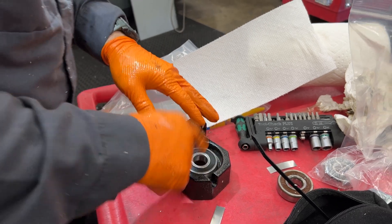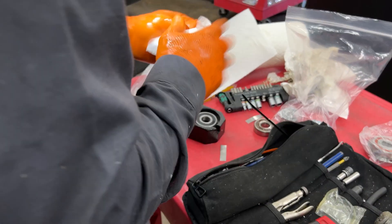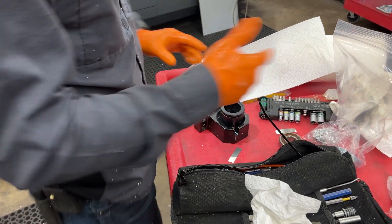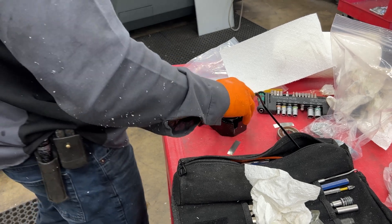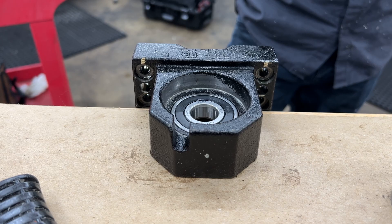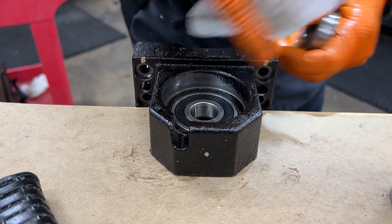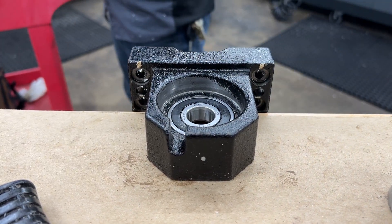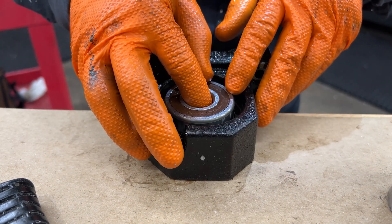I have a tool that I put on here — I'll put it in place and tap it in. I typically use one of these plastic pieces so I hit the outer race, because you don't want to hit the inner race. Sometimes it catches the edge, so I'll use the older bearing to stick it on there and make sure it's sitting all the way flat against it.